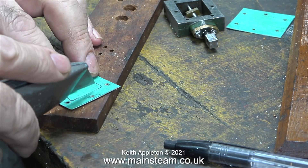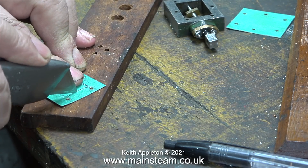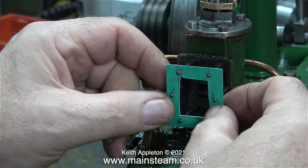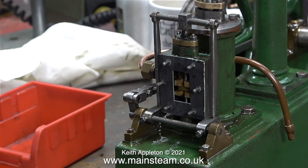Not just the outer part of the gasket — I also need to cut out the inside. You can actually leave the inside in one piece on the steam chest cover gasket, but I never do that because I have seen them go soggy and break up and drop into the engine. This clip shows that the outer part of the gaskets are slightly oversized, but this is normal — I always trim these once they're all bolted together.